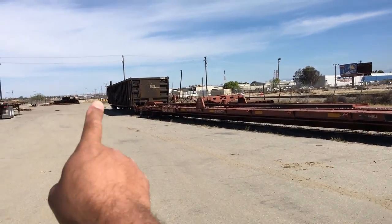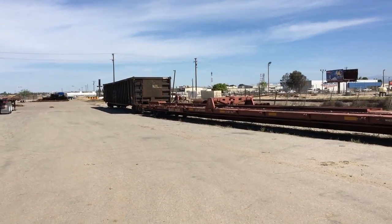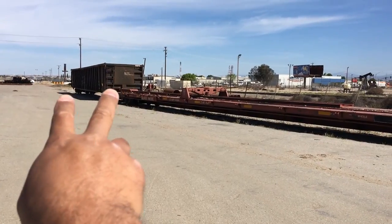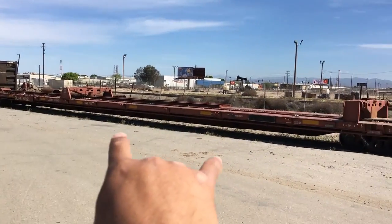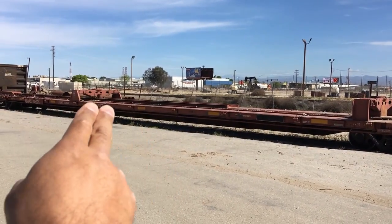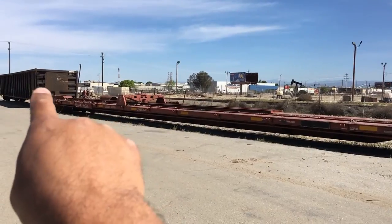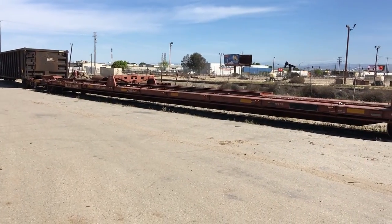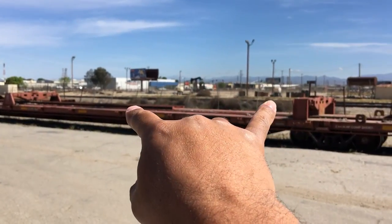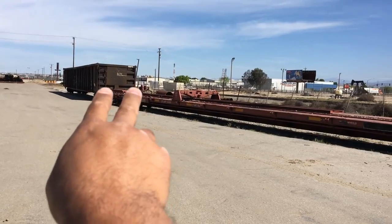The concept behind an ambulance car: let's say that rail car over there gets in an accident and needs to be repaired, and it's too damaged to go back on its own wheels. They would get that rail car, pick it up, and set it on that truck bolster. The truck bolster is movable - it slides back and forth. They load the rail car - it can be a tank car, a flat car, whatever kind of car - they load it down on this, then strap it down.